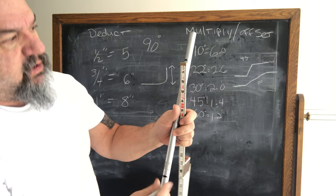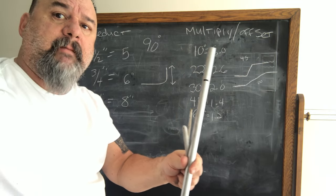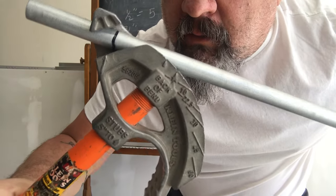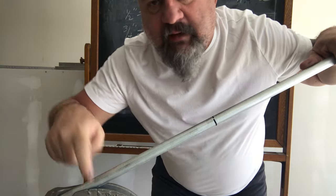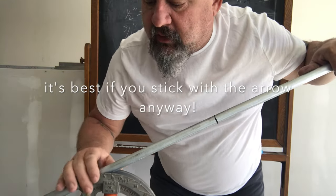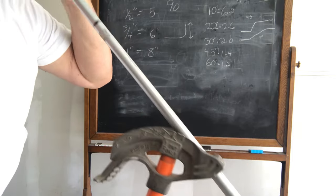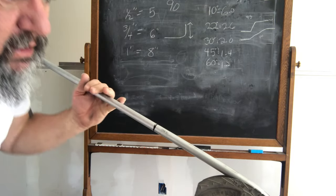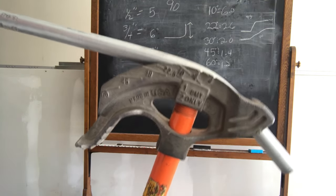Simple as that. Now I'll show you on the bender how we get that six-inch offset. Here's my first mark — remember that little arrow, get it right in there. With an offset you could use any of the marks as long as the distance between them stays the same. The bender doesn't know the difference, but rule of thumb: this arrow is the beginning of your bend. We're going to 30 degrees — bend it down until it's parallel with that 30-degree mark.